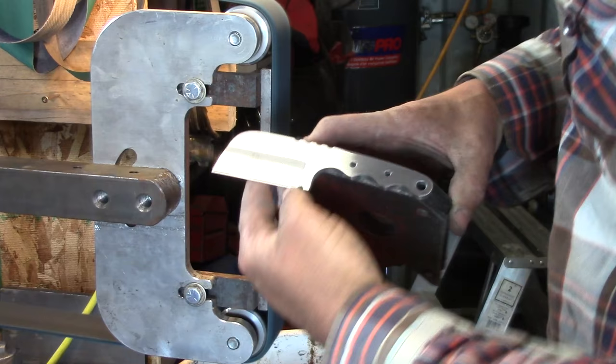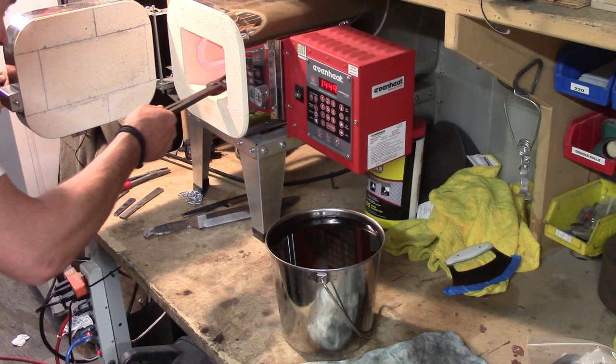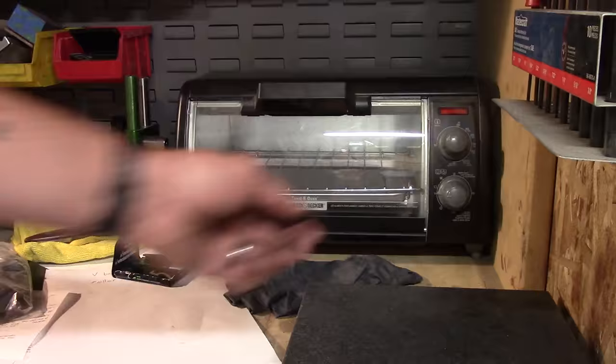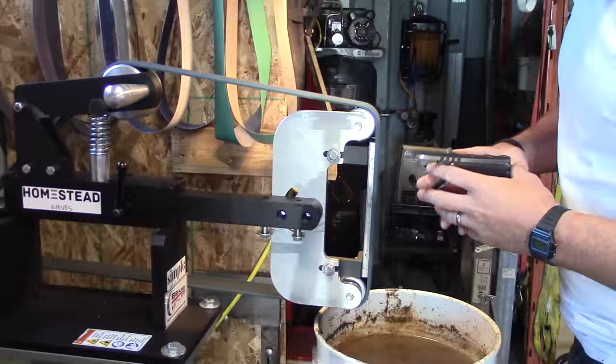We're ready for heat treat. For this one I did 1450°F for 15 minutes. I've been trying slightly higher temperatures but was getting really bad finishes on the steel, so 1450°F is hot enough and long enough without the metal going crazy on you. The other option is using foil envelopes, but with O1 tool steel you can get a pretty good harden without getting too complicated. After hardening, I temper it — two cycles at 450°F for 20 minutes each — then hit it with the surface conditioning belt to remove all the scale.